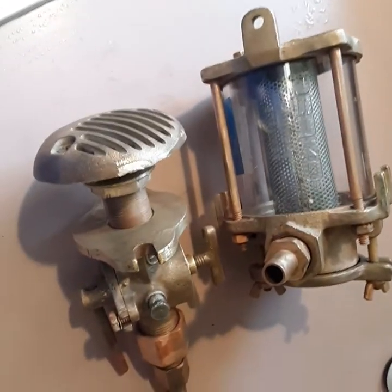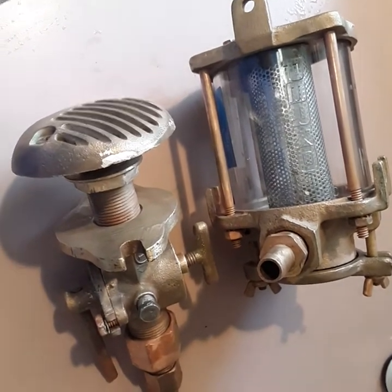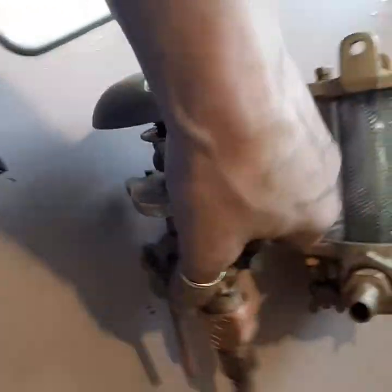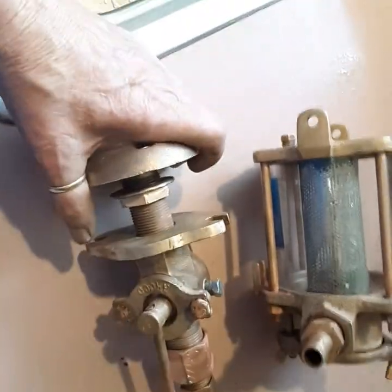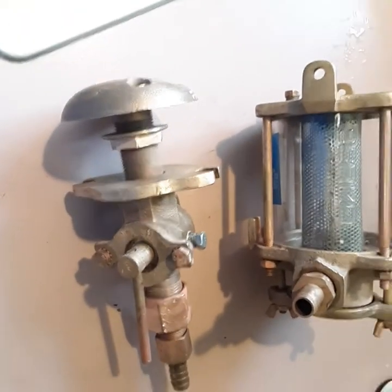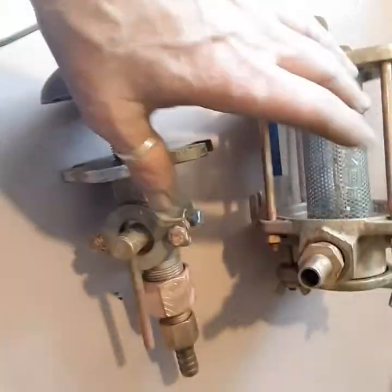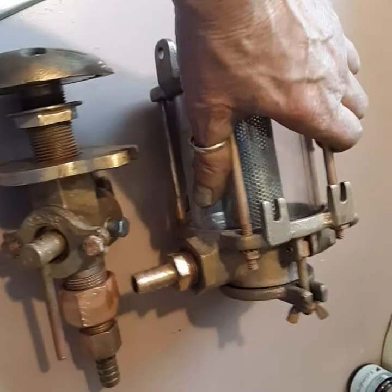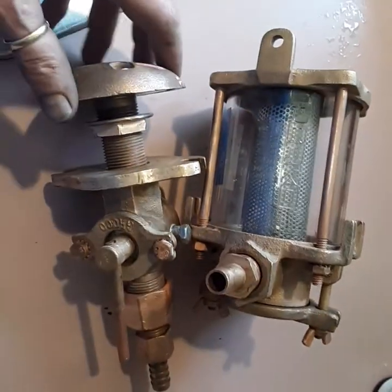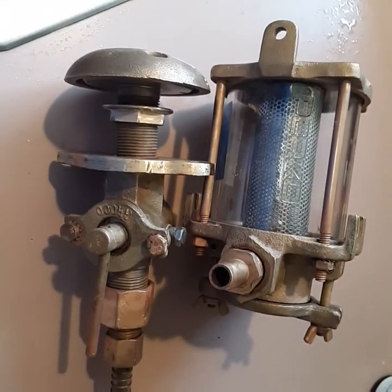And so that's where we are on the water strainer. It looks great, it's all cleaned up, the valve works nicely. I'm happy with it. I do have some Lanacoat, which is used to put dissimilar metals together, and I'm definitely going to go through all these bolts and fittings, and everything is going to get Lanacoat on it so that everything will move very easily with time. Yeah, so I'm looking forward to getting this back in the boat though, because it's a beautiful piece.